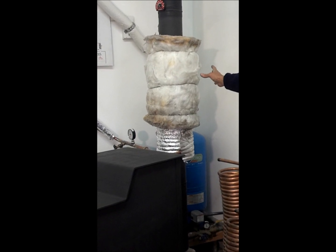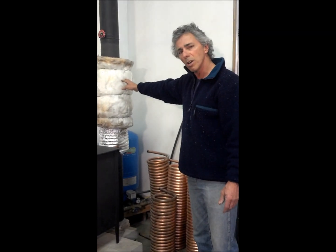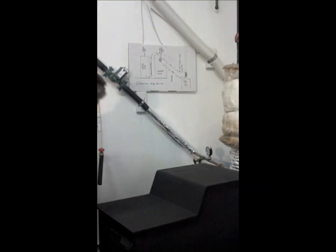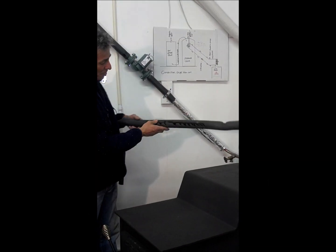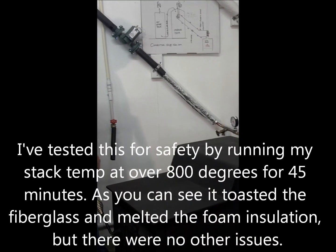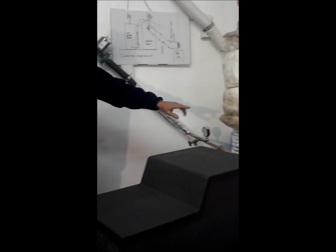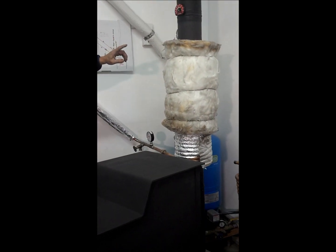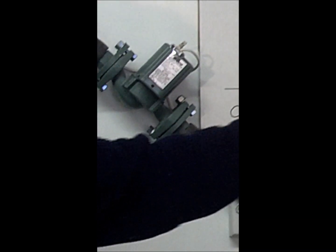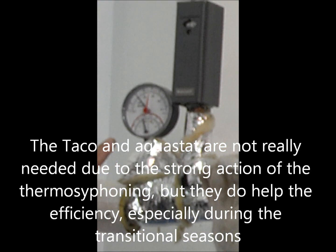Eventually I'll build a shell to put on there to make it look finished. I've also bought some mineral wool — Roxul — to use in lieu of the fiberglass, but the Roxul seems to want to break apart rather than mold around there. I've run this thing so hot that the insulation on the cold water return shows cracking — that's from the radiant heat from the wood stove, not from the hot water in the pipe. The aluminum foil stopped that entirely. This coil uses convection — water rising — and I equipped my system with a circulator, just to be sure while testing. That circulator is controlled by a Honeywell aquastat, and a temperature and pressure gauge so I can monitor what's going on.